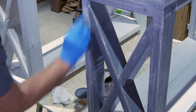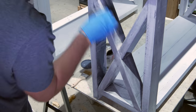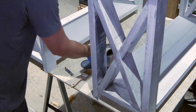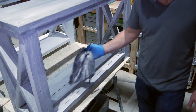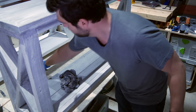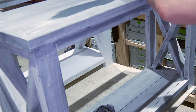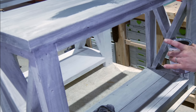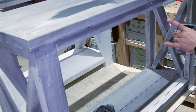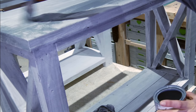The semi-gloss paint really allows me to control the distressed look and work much faster. Once I achieved the look I was after, I moved to the next section and repeated the process. This is looking good, but I want to darken up the top a little bit more — I think I wiped it a little too soon. So I'm going to put a bit more stain up here and let it sit for a few minutes, not as long as the first time, but this will just add a bit more depth.